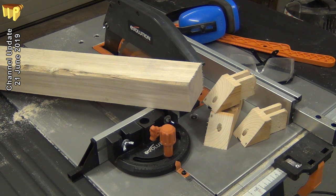The rise and fall is now working perfectly. I've reset the parallel for the fence and the 90 degrees for the mitre square. I've also set the bevel angle 0 and 45 degree set stops, and it's ready to go. I'm not going to do a formal review here — what I'm going to do is use it to make a furniture project and let you know how I get on with it during the process. Cheerio!